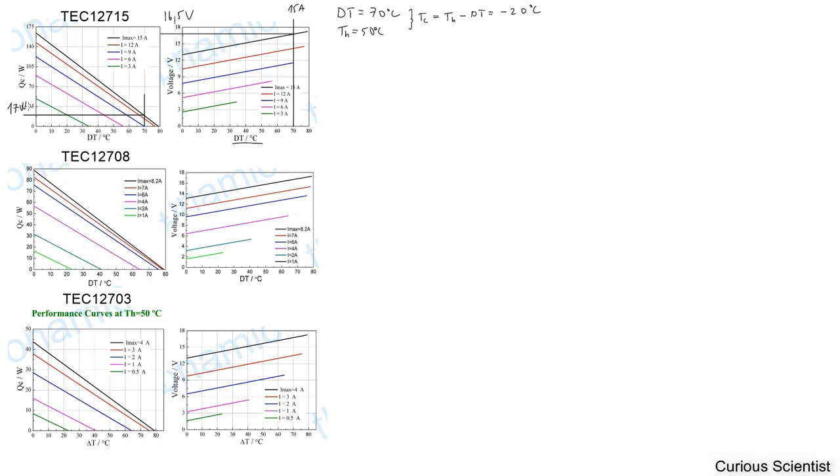We see that this is roughly 17 or 18 watts of cooling power. So if you want to maintain minus 20°C on the cold side of the TEC 12715, you can only provide 17 to 18 watts of cooling power, which is very low for different purposes. Very low cooling power is achieved if you have large DT, and the reverse is also valid: if you want high cooling power, you have to sacrifice the DT. Either you get very low temperature but can't cool anything, or you get very high cooling rate but can't create a large temperature difference.